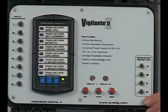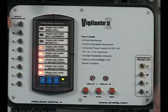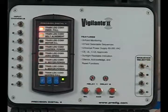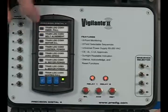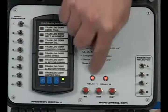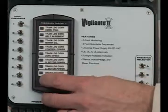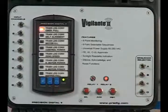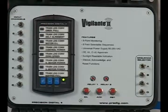When an alarm occurs, I'm going to program this for ISA Sequence A by rearranging the DIP switches. It goes through a warm-up sequence and is now ready for operation. When an alarm trips, a light lights up, a horn sounds, and you'll notice these two relays trip. The operator silences the alarm and then acknowledges it, but we still have the alarm condition present, so the light will stay on until the switch is closed again.